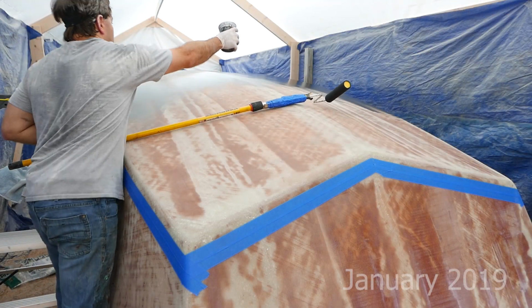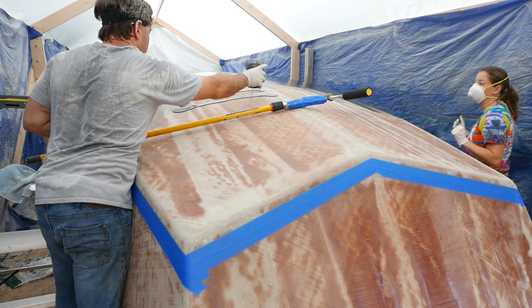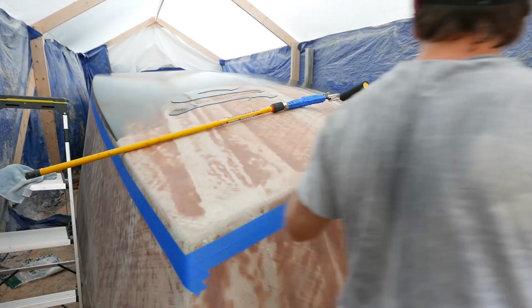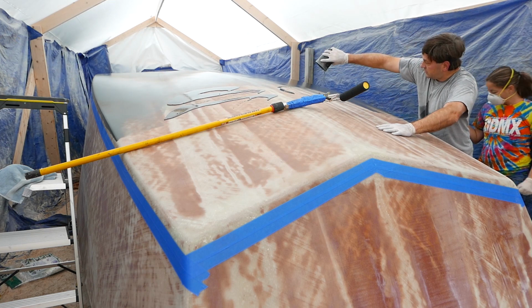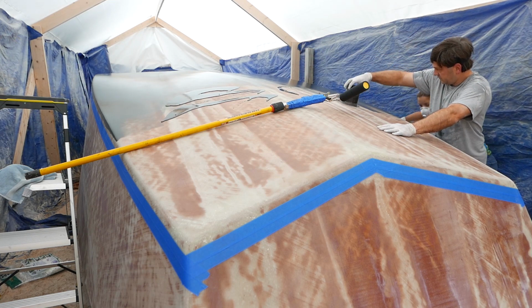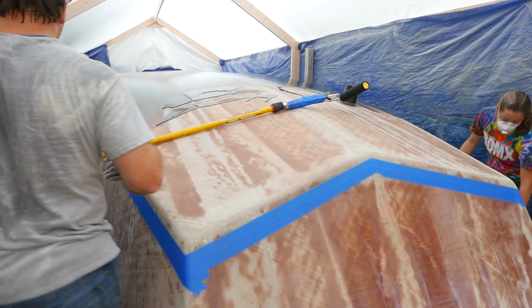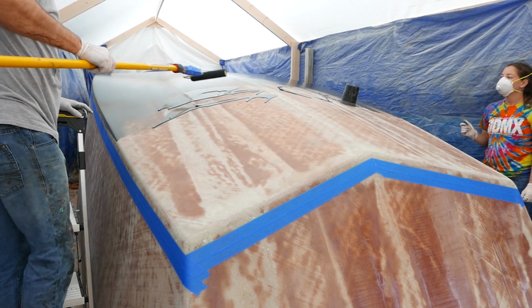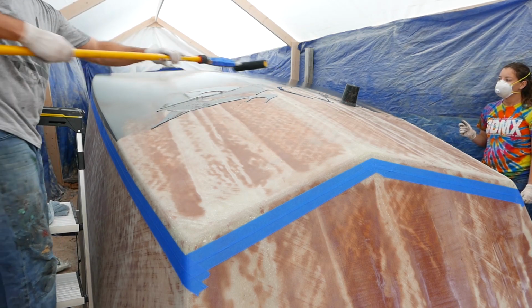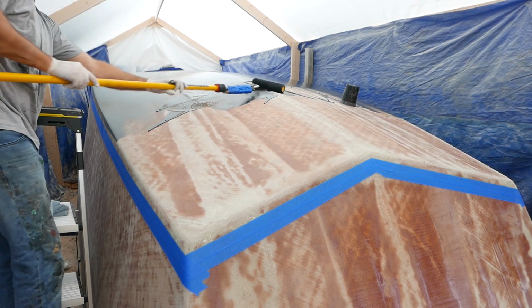After weeks of fairing and sanding, it was time to apply the final coatings to the hull. For the bottom, we decided on a mixture of epoxy thickened with graphite. Graphite is used as an industrial lubricant, and the resulting hard but slippery surface is said to provide much better abrasion resistance than most commercially available bottom paints. Epoxy degrades under exposure to UV, so we will only use this mixture on the bottom, which will not receive direct sunlight either on the trailer or in the water.